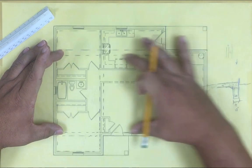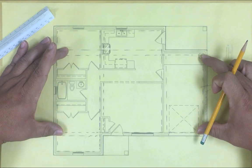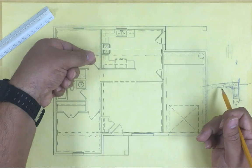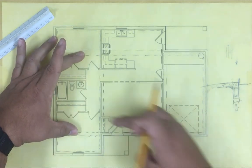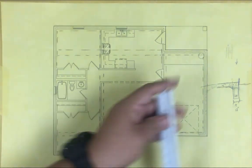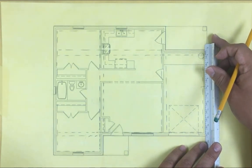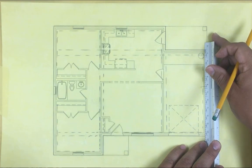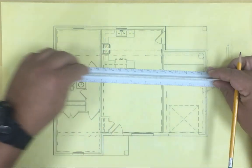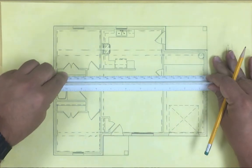So it seems we have a big span there. For the purpose of the project I'm just gonna put a footing in between these two - I have a footing right here and a footing right here with a span of slab in between - so I'm gonna put one right in the middle. From footing to footing it's about 20 to 21 feet, so I'll put one somewhere here. Again it should be 12 inches wide - I'm eyeballing it. I'll put one here and one here.